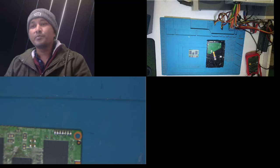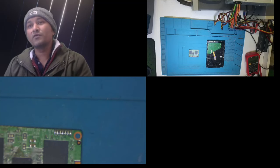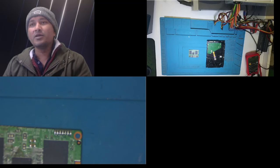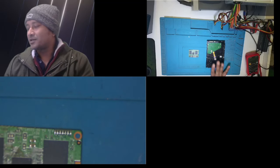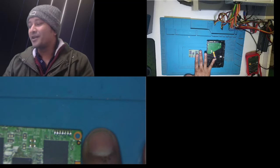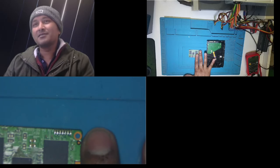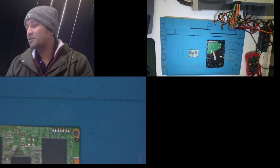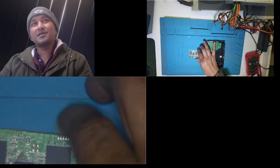These two power supplies that I have are from totally different companies. Only later on, after I blew these hard drives and this SSD, I found out on YouTube that I mustn't do that. I should always use the cables that each individual power supply comes with. Do not mix and match with the old PSU's or other PSU's power cables. So anyway, this is done.